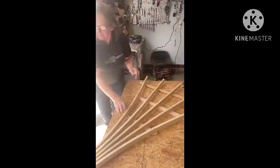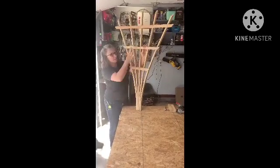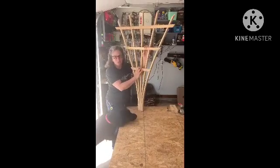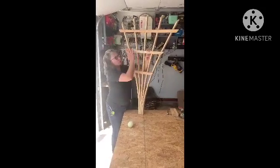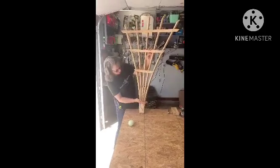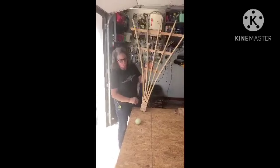All right, go away. So we have a 4-foot trellis, and we went with the bolts on the outside just because once your vines get big and heavy on them, I just didn't feel that the air nails or brad nails were going to be enough to hold up to that. So I thought that might be a little bit better. I don't know if it is or not, but it doesn't cost that much more to do that on those. And then you could put a smaller one here if you want to, but I figure by the time you sit it in your pot or whatever, your plant isn't going to start till here anyways. So that is our version of this.